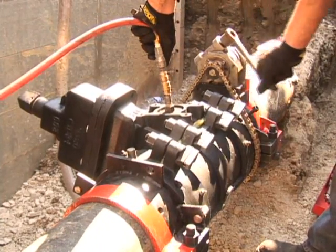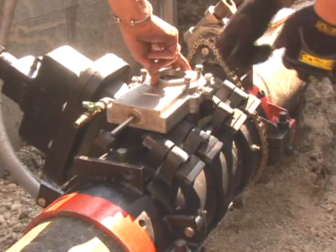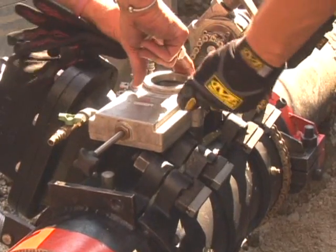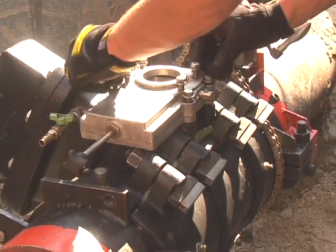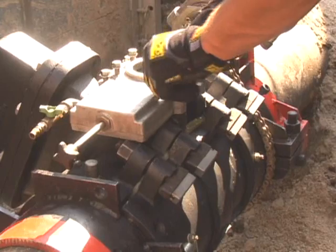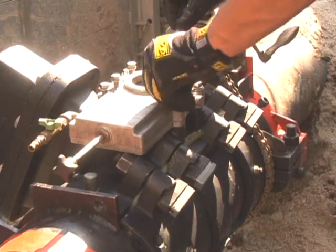The cutting operation is now ready to proceed. The technicians install the temporary valve — we use the word 'temporary' because at the end of the installation, the temporary valve is removed and is designed to be reusable for future EZ valve installations. The temporary valve allows the EZ valve cutting unit to be installed and removed while under pressure.